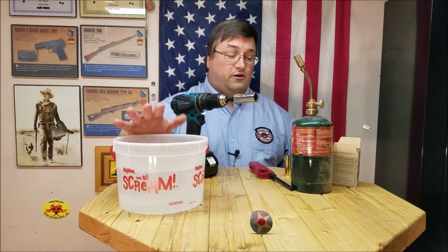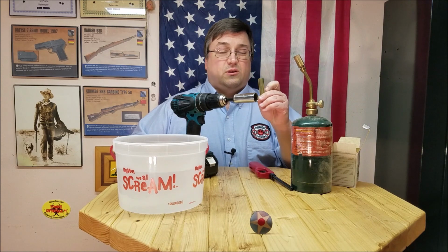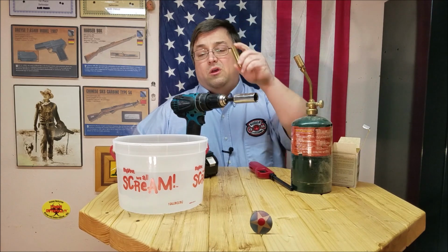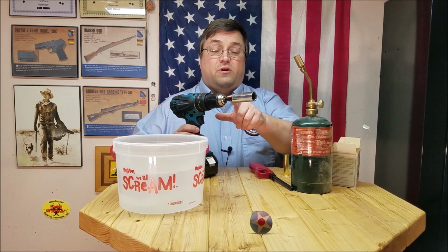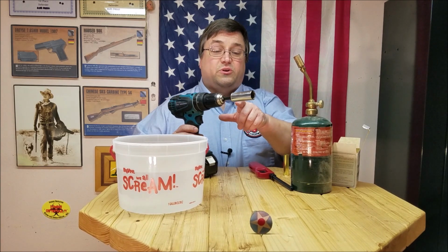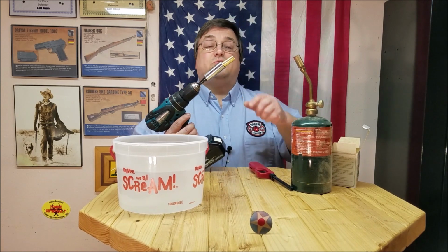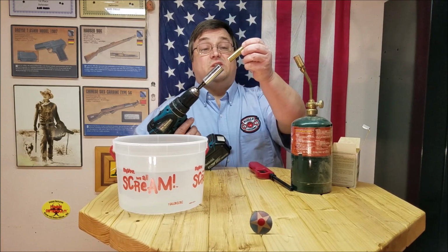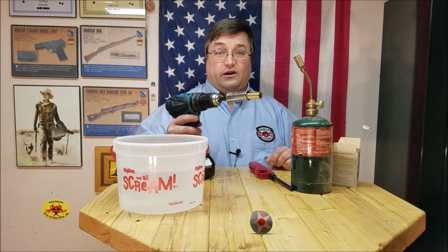I've got some water here. Got a torch here. We're going to heat this up till it turns about a dark purple, and then we're going to dip it in the water. We've got a 3/8 drive here on the drill and a 3/4 inch deep socket. It just kind of goes in there. It's just nice. You're going to anneal the area of the case that I need to. But let's go ahead and get started.